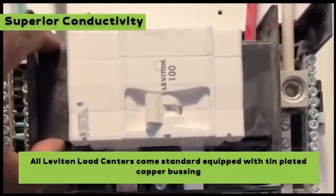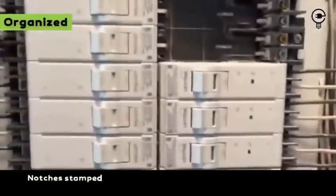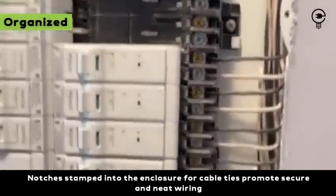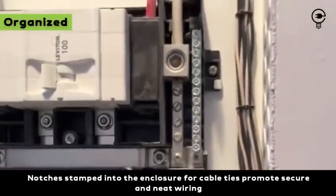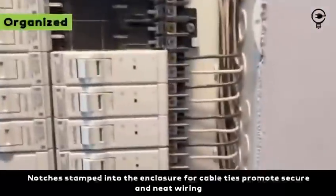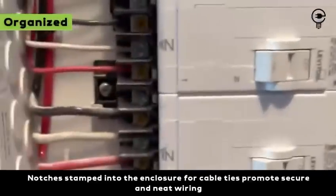What we also love about this panel is the protection — look at this protection right here. What we did in this panel is bring everything down. This is your neutral and your hot. For your actual breakers, your arc-fault and ground-fault protection, everything will come down here straight to the lug. Over here will be all your neutral for things like AC and everything. But at Cadet Electric we go beyond code — everything in this panel is going to be arc-fault and ground-fault protected, whether or not we already have a GFI. We do things beyond code here, making it easy for when the inspector comes.